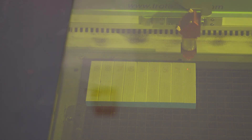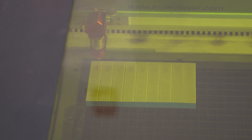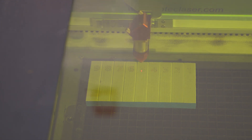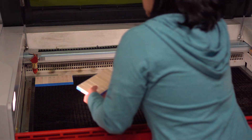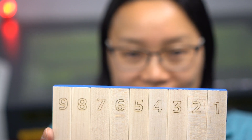If I had solid numbers, the engraving process would require the laser to burn the wood a row at a time like an inkjet printer. So I turned the numbers into vector outlines and performed a light profile cut. I set the power very low and the speed very high, so that the laser line does not cut through the wooden pins. For this project, the shallow cut lines work well and look great.